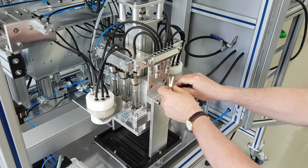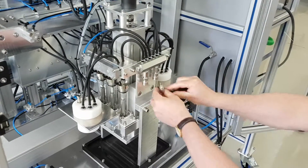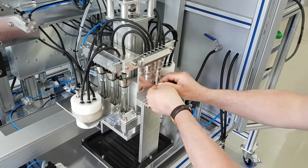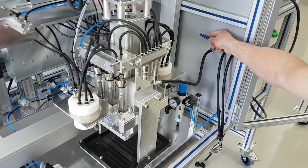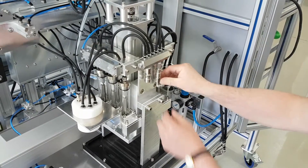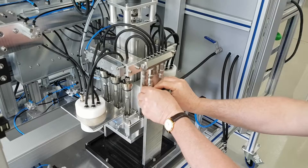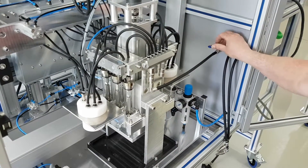There is a hose connection assembled onto the waste tank which can be alternatively connected to the syringe unit for draining the filling path. Using these features allows draining the ink-contacting parts of the filling system almost completely, which is especially important when changing between different incompatible ink qualities.